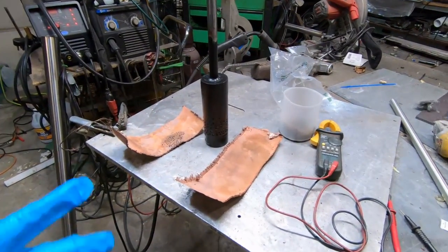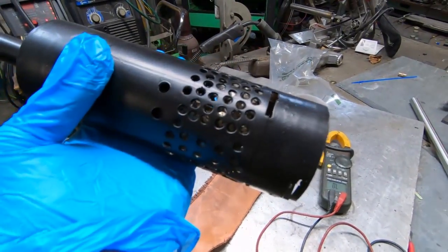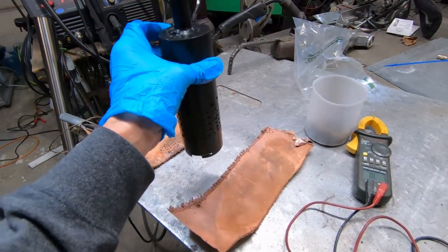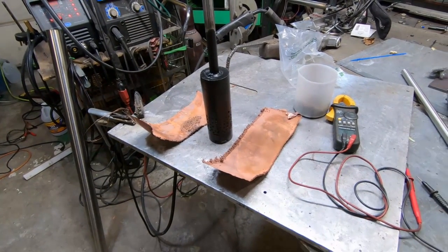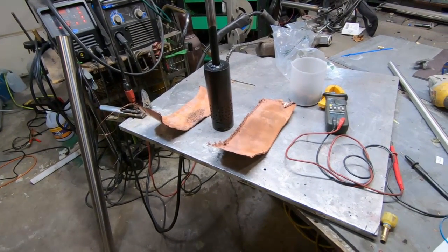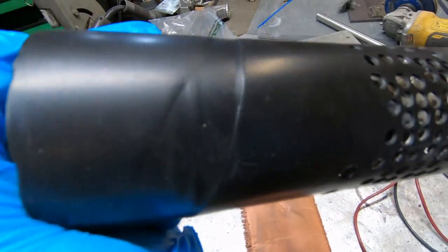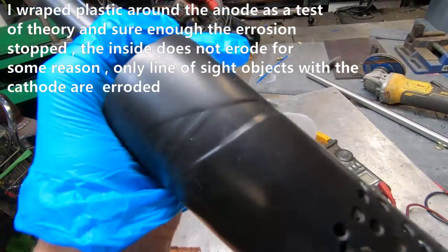Before I freak anybody out in the comment section, I do not intend to use this material as the actual coating. I would probably go with a glass coating if I decide to try this method to protect the anode for as long as possible. You could get years of service out of this thing if it's done out of the right material. They currently have anode baskets in service for other plating processes, though the energy densities are a lot milder in those conditions. The whole reason I decided to do it is because I noticed, after I painted this, you can see where the anode dissolves at different rates depending on its exposure to the cathode.